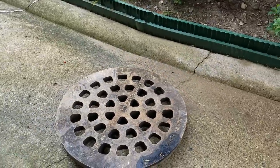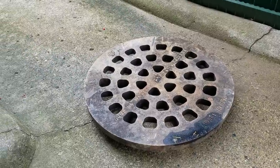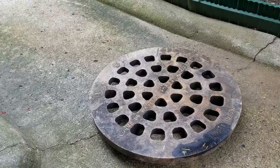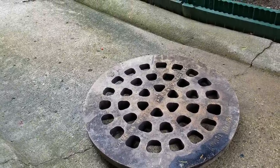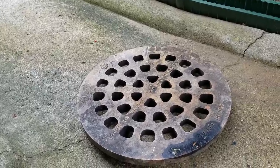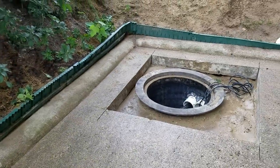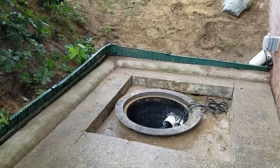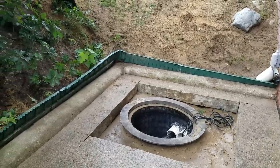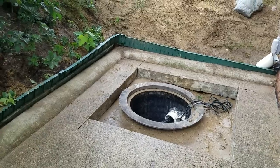When you go five and a half feet deep, that prevents it from freezing up. You're going to lose heat even though you're deep enough to get ground heat, because you lose heat with one of these covers. You definitely want to be at that five-to-six-foot depth — we ended up right at five and a half feet. Even with an open grate losing some heat, we're deep enough to keep this pit from freezing. With a solid cover you can go a little shallower; we have some 48-inch systems in with solid covers, but as a rule of thumb we're always shooting for five to six feet.